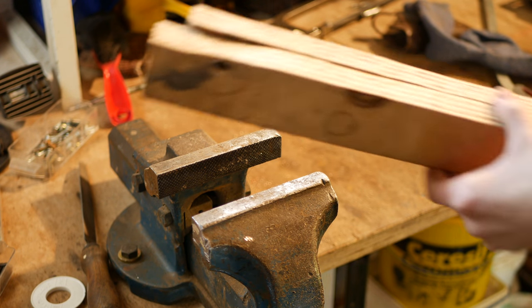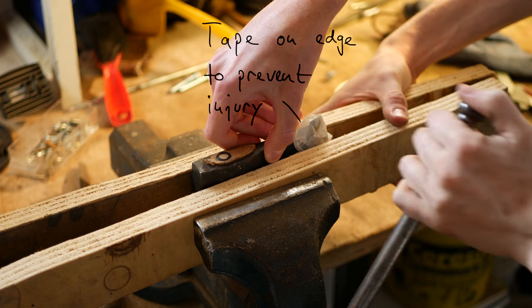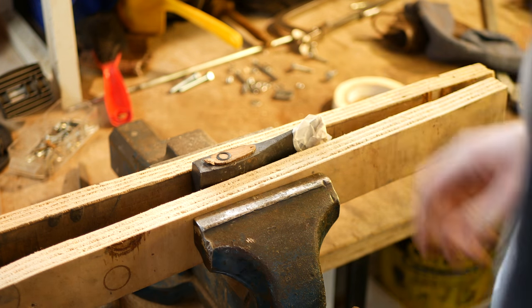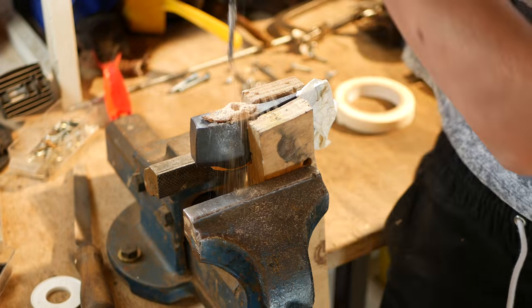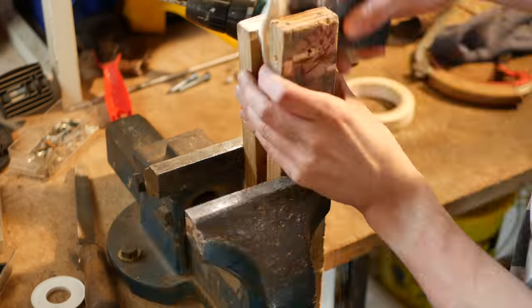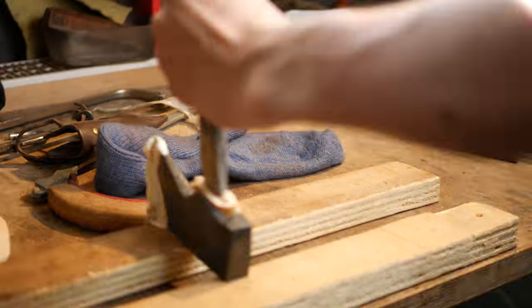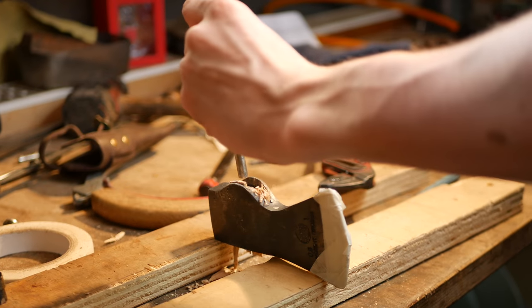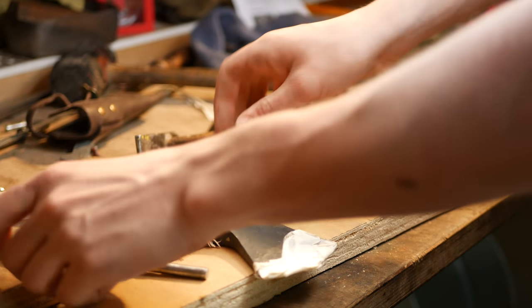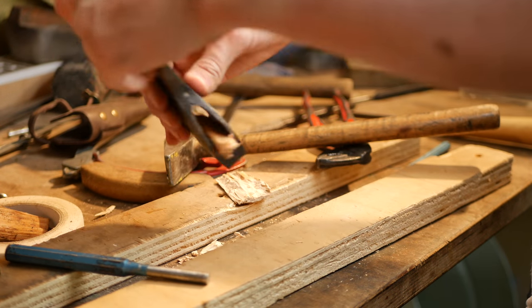This is so painful to do. Now we need to drill out the remaining wood. We do have to clamp the head of the hatchet here, so use wood to prevent deforming. It was an absolute pain to drill out the remaining wood in the eye — we even used a drill press, which didn't work as planned either. The wood was extremely robust and almost seemed glued to the head, though it actually wasn't. We eventually got it out. Finally!